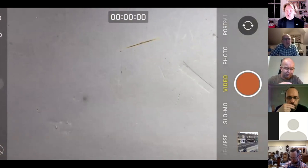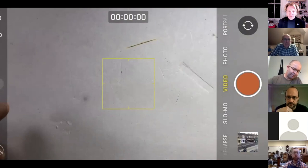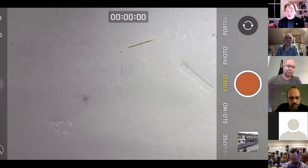So last week, when I got myself into that bit of a mess, there were two things I could have done to improve the situation. As it was, I made a new bush, so it was okay-ish. But if you're making really fine components, the file trick is actually pretty good. It's like a knurl, isn't it? Like a diamond knurl, or for valve guides, knurling. All right, okay, for valve guides. So it's something that's known to other people as well.